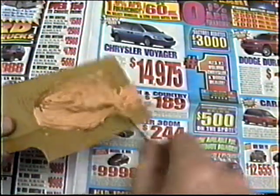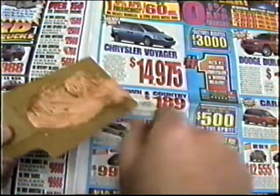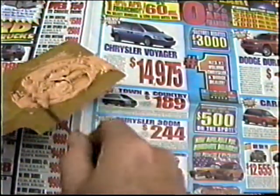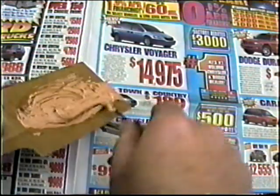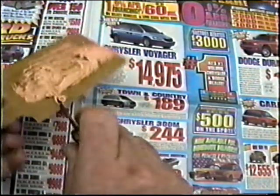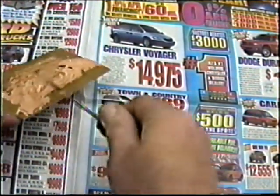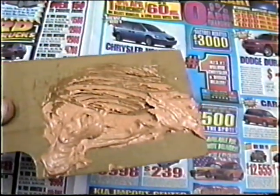Now, I want to get some... I'm really mixing the aeropoxy well, because we're going to try to get a real thin fillet in there. Anytime you mix aeropoxy, when you think it's mixed, give it another 2 minutes of mix. We don't need dye in this. The normal color will be fine. And you can see over the course of building this airplane how many different uses we've found, as we're going along, for this good material. It's really a good material.